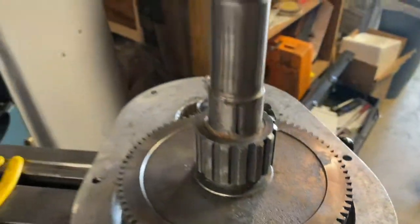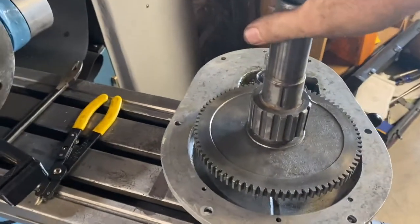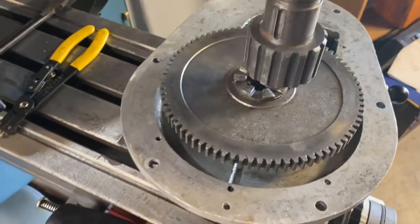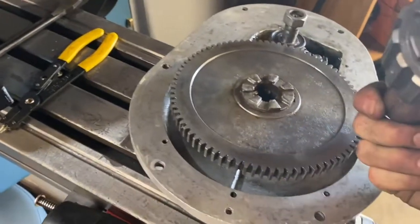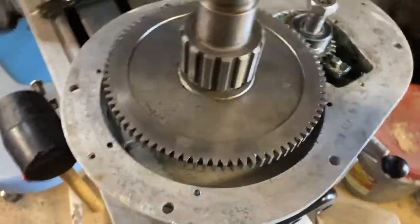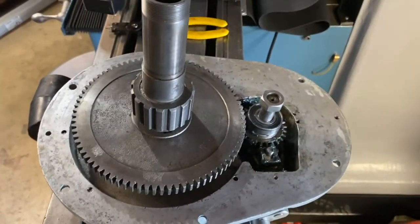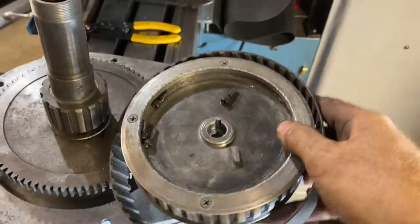I'll just tell you that this mill is a restoration project. It received a lot of abuse, had a lot of rust on it, and so this pitting is the best that I could get that cleaned up. Now there are two ways that the power can be transmitted. One is through this bottom with those two connecting, and the second way is via this belt, and it goes over to a wheel here. Let me show that.